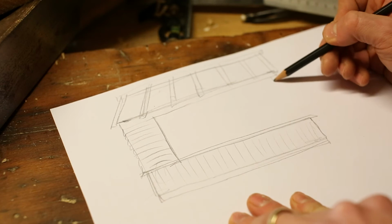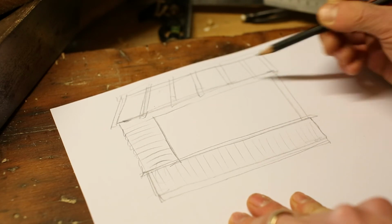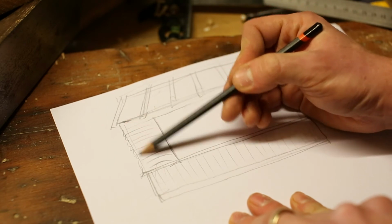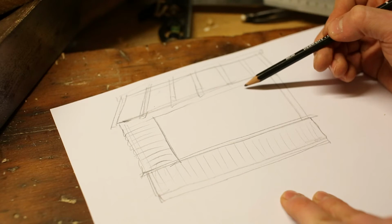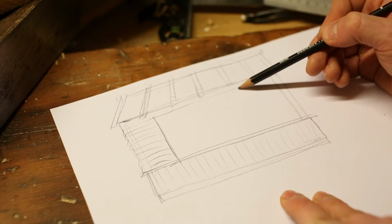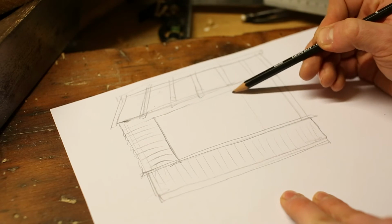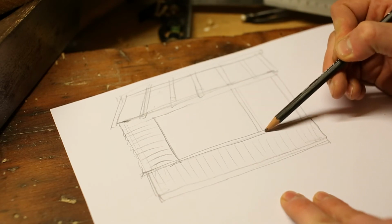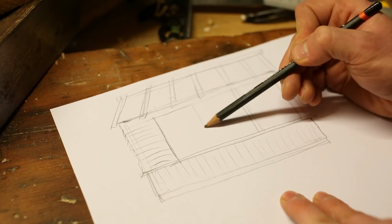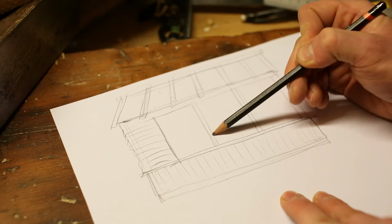Now when it comes to this wall, I'll probably use 4x4s on the corners. So we'll have a nice solid structure, and again there'll be a 4x4 behind here. Then the carcassing itself, the stud work, will be made up of 2x4. So it'll all be dictated by the windows that I mentioned, and I've got 3 of them. And they have their own frames.